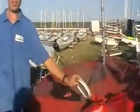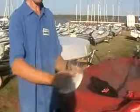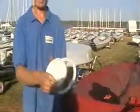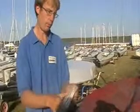Before you launch into a pressure test, the best thing to do is make sure that all the hatches are sealed up properly. These Seashore hatches, or even RWA ones, are really, really good and don't tend to be a problem with the O-rings because they tend to be out of the sun. However, it's still worth cleaning them if you've got these on your boat.